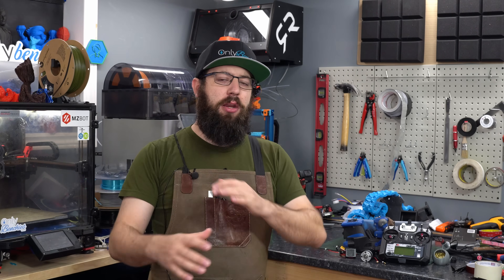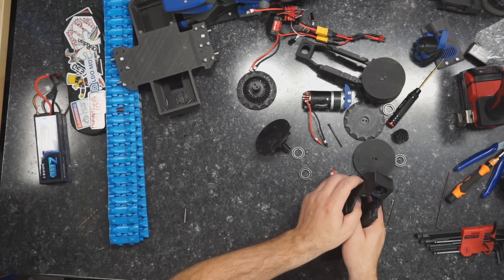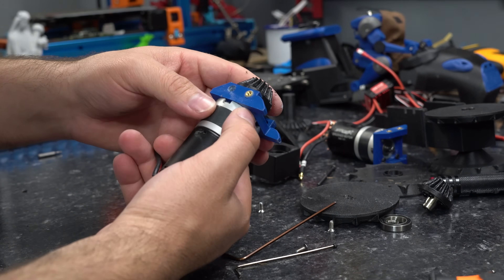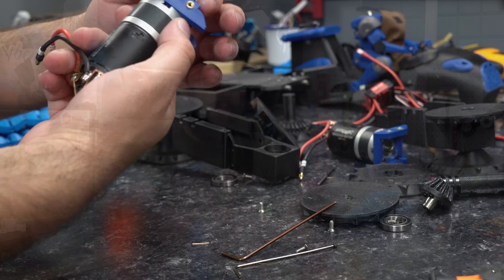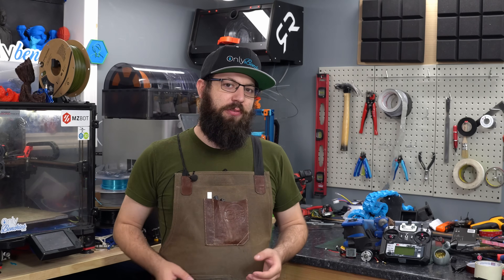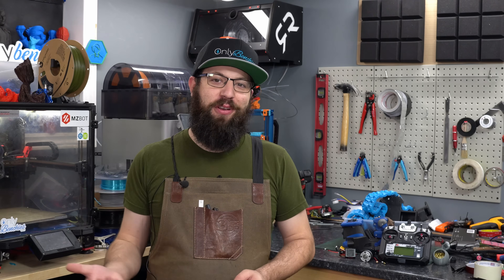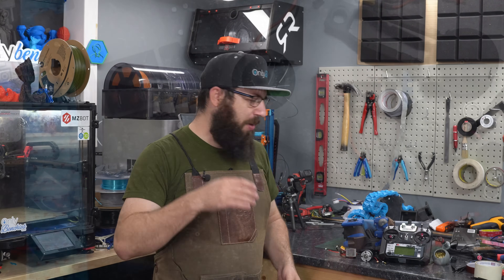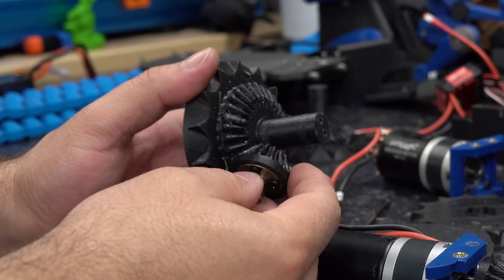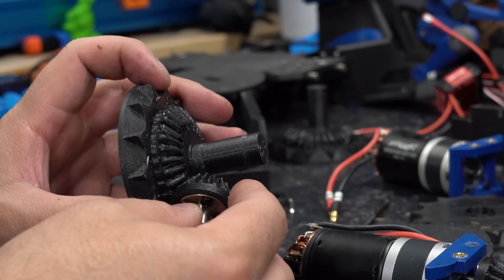For the motor mounts, I did a modification so the motors would mount to the plastic part screwing into heat sets instead of directly into plastic, hoping to get more grip. I'm not a huge fan of driving screws into plastic parts to affix a motor. Unfortunately, as I found out during the teardown, the heat sets ripped out. I don't know if my quick Windows 3D Builder hack to put holes in for heat sets used the right size — I can't remember, and unfortunately I didn't save the STLs. So my motors were no longer rigidly mounted, which means they could wobble, which means they never got good engagement with the drive gears. By the end of the second day, everything was just kind of all over the place and it was limping along.